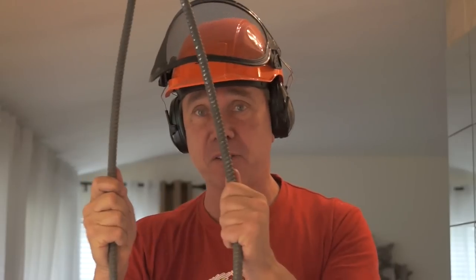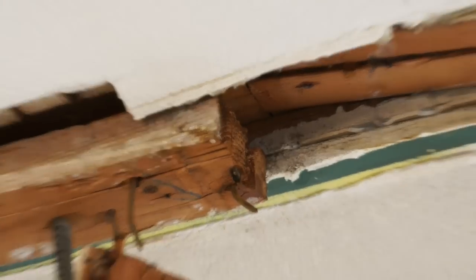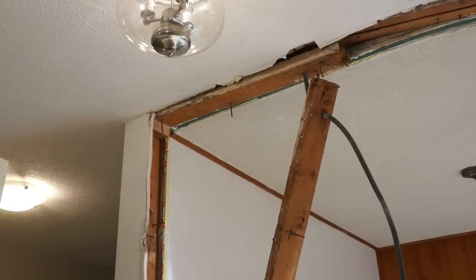It's the end of a long day, and clearly where there once was a wall there is not. All we have left are some live electrical cables — it's BX cable, so it's armored, which means we'll need to do some electrical work to reroute the wires. My plan is to take some of the wood beams on top that were framing the door, remove them, rerun the cable, and mount the switches over here with the power down below. You may need to get an electrical permit or an electrician if you're not familiar with electrical work.